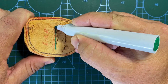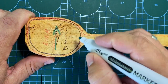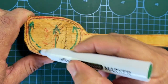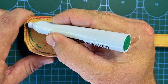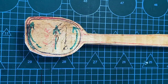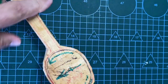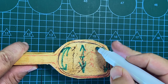You want to go across the grain as much as possible, but obviously on the ends you have the rounds. So still go across the grain but you can go on a sweeping action, and same with around here. You can see that I've drawn in my rim for my bowl — we'll call that the no-go zone. We don't want to touch this area at the moment; you can finesse that later with a hook knife. Some people will find it's easier to start from the middle and go that way, then switch it around and go back the other way. Same with on the ends — you can go either way.